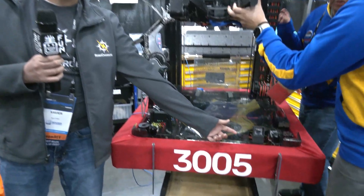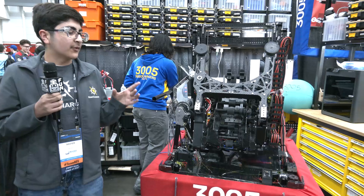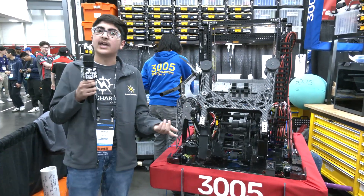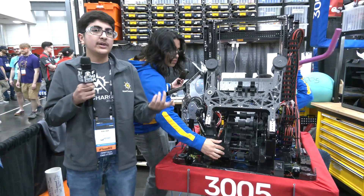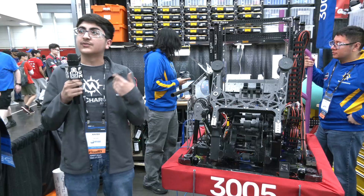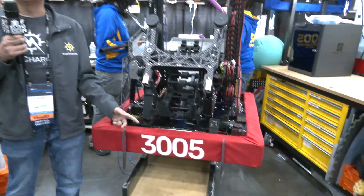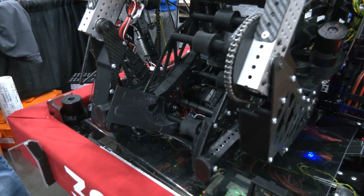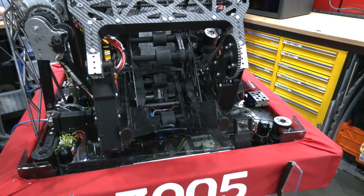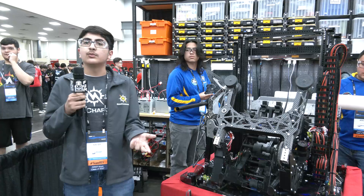The robot uses one front-facing camera fed through PhotonVision for field positioning. The reef is divided like a pie chart — if the robot is in one section, it only targets those two reef positions and their levels. The robot snaps to the correct angle and locks onto it from any position. This approach ensures that even if a coral is between the robot and the reef, the target is always hit. Distance from the reef is also calculated to prevent accidentally hitting it or firing too early. The front through-beam sensor detects coral position during intaking, while the outer through-beam sensor is multi-use — detecting coral that's too far out and triggering automatic scoring as soon as the reef contact is detected.